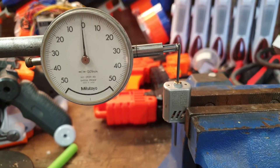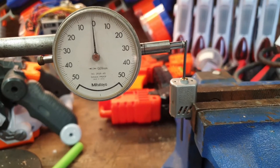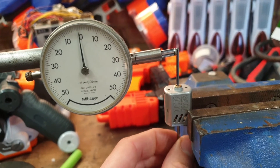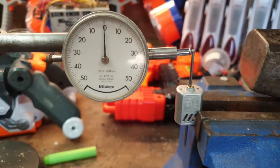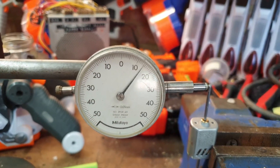One of the main reasons for making a jig is that during the install process the shaft may have got a little bent, and we don't want that because it induces vibration in the flywheels. There's about 0.05mm of runout. While that can no doubt be fixed with the old machinist's solution, we don't really want to resort to that because it's time consuming — it's better that it's straight in the first place.